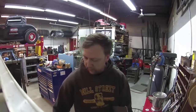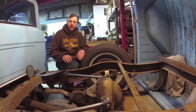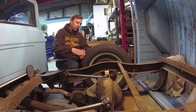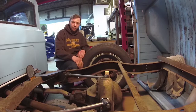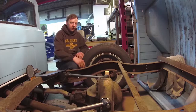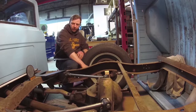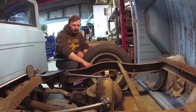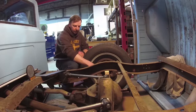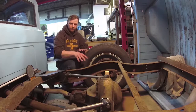So now I'll take you over to the truck and get an idea of what we're working with. Here's the truck frame. I've got it mocked up at ride height, which is important because you want to know how far down the frame is going to go and how far up into the frame you need clearance for. So it's at ride height. My bottom bars are level pretty much and I've got just a spacer in here — this is an inch and a half block of wood to let it sit down and rest at ride height.